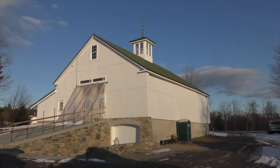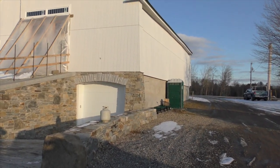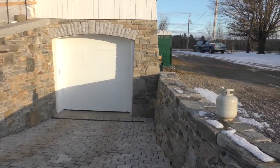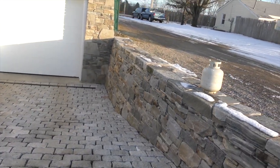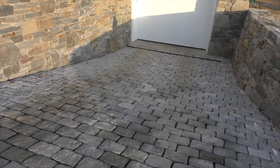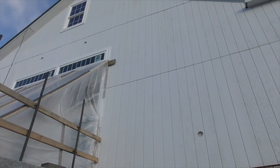Let's go look inside. The foundation walls are a product called NuDura — it's styrofoam with hard plastic in it. You clip them together like Legos, then fill with concrete. As a mason, he's built a beautiful retaining wall and this arch, as well as a cobblestone path all the way down into the barn. Up here you can see all these holes — these are for can lights that are going to shine down and illuminate the barn at night.